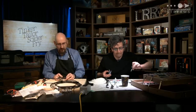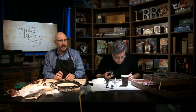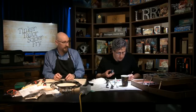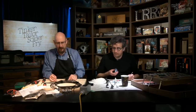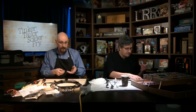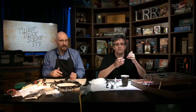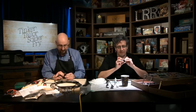Were you around when I brought in my Thrustmaster from back in the day? I wasn't. This is one of the long-term projects I've got on the go. It was an old ADB, the Apple Desktop Bus Thrustmaster system, which is old and gone, but the joystick is still functional. So I've spent a few hours mapping out all of the buttons in it. The next step is grabbing a microcontroller, plugging them all in, and programming that to be a new joystick. I'm going to eventually have a USB Thrustmaster from the 90s. Nice. Gonna put in heavier weighted springs?